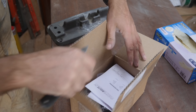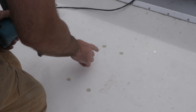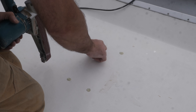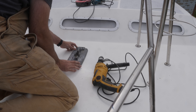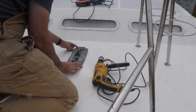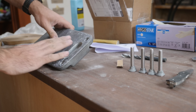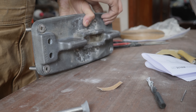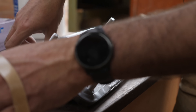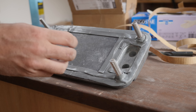This should be the bolts and nuts I ordered for the mast foot, so hopefully we can get that installed too. These are 60 millimeters long — they should be long enough, but just to be safe I also ordered some 100-millimeter ones. Earlier in the week I filled these holes with thickened epoxy, and it's a little bit proud of the surface, so before I do anything else I want to knock that back down. It looks like the holes still line up, which is very fortunate. I've cleaned up the corrosion on the bottom and applied butyl tape to the heads of each of the bolts. Once this gets tightened down, all of this butyl is going to squeeze together into one big blob.